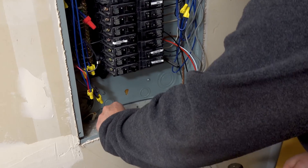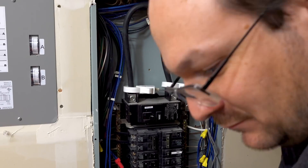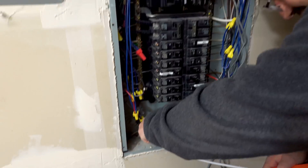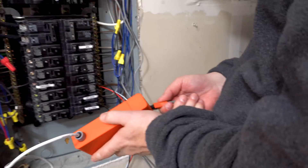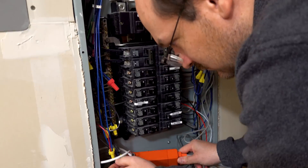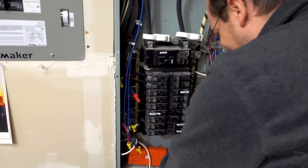We're going to make a hole for the wires to take the Wi-Fi antenna outside of the Faraday cage. So to you lazy installers like I would have been - don't just throw the antenna in there amongst all the wires inside the case, otherwise it probably won't work. Alright, the antenna is literally designed to fit right into that hole diameter, that's cool. So now we've got the box, the two wires going into two breakers, and those two breakers are not in use. Per code depending on your area you may not be allowed to use existing breakers, but technically it'll work.